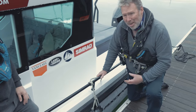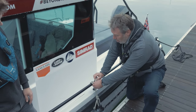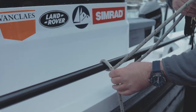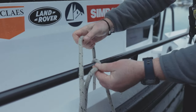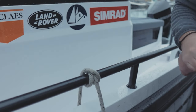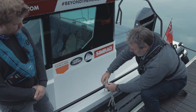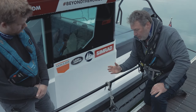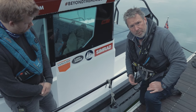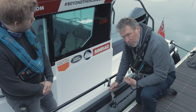Lots of knots does actually work, but we've got two main ways of attaching a fender to a rail here. What we've got here is we're using a clove hitch. If I show you how we tie that — we start off by putting it over the top and then crossing, going towards Tom here and actually coming up through that gap. You can see a clove hitch is defined by the way that line crosses over the other two. The great things about a clove hitch are that we can easily lower or raise that fender, so it's quick and we can raise and lower it really quickly when we come alongside, which is quite often what we need to do to adjust the fender relative to the height of the pontoons. But it's not necessarily the most secure, insofar as if the fender's coming under some load alongside the pontoon over time, it could break free.